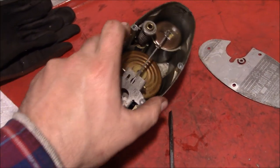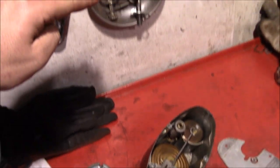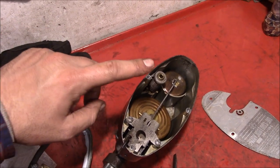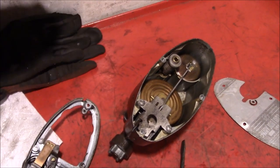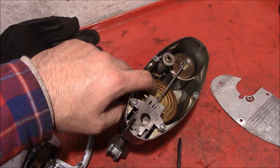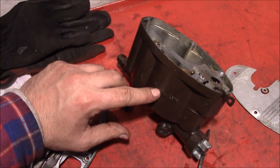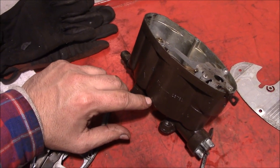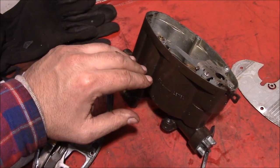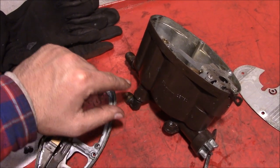That's where your constant level comes into play. When you have an oil tank outside, whether it's completely full or almost empty, as long as the bottom of that tank is somewhere above this valve right here, it's going to gravity feed fuel into it. But this float right here is going to stop the level within the control valve at this point. So you'll always have fuel sitting right here at this point, giving you the same static pressure pushing through that little slot and flowing into the furnace.